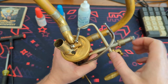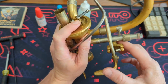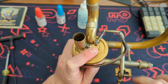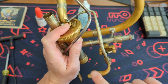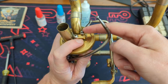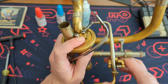You're going to hold the stop arm, which is the guy attached to the end of the valve here on the spindle. You're going to hold that in place and then move the lever. This screw is loose. You want all of the action of this to go directly into the valve. And if anything on that path is loose or not lubricated, it's going to make noise because it's wasting energy.